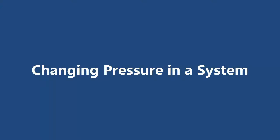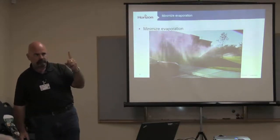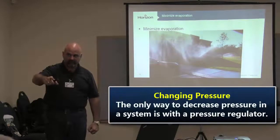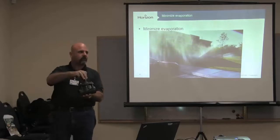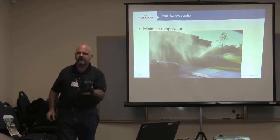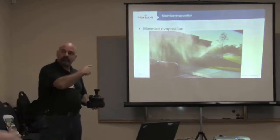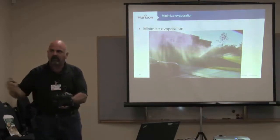Can you change pressure any other way on a system? How do you make pressure go up? There's only one way — a pump. You can only make pressure go up with a pump. There's only one way to make pressure go down — a pressure regulator. Now I'm going to get the question: oh, you can make pressure go down, all you've got to do is crank down the flow control. We've got smart guys in here because that always comes up. No — that doesn't change pressure. That changes velocity, how fast the water is going through the valve. Velocity changes will look like pressure reduction, but that's not what it is, because your pressure is still the same on the incoming and outgoing unless you have a PRS dial or some sort of regulator on it.